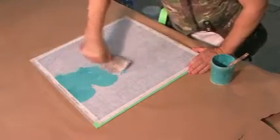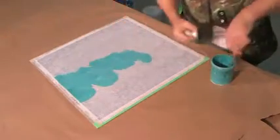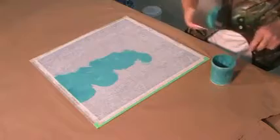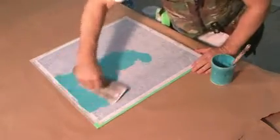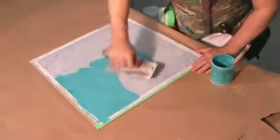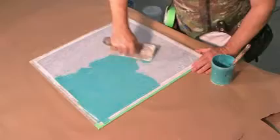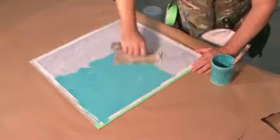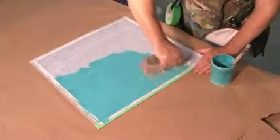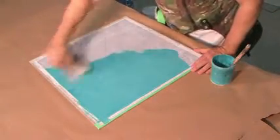Begin by distributing very small, tight quantities of plaster onto your working surface with a consistent stroke regardless of direction. You should be pulling your trowel very tightly over the surface, as lime plaster has the ability to build a pattern from every stroke. The trowel being used is a stainless steel stucco trowel that gives the applicator a firm, controlled stroke. Allow each coat to dry before applying any additional coats of VersiLime.